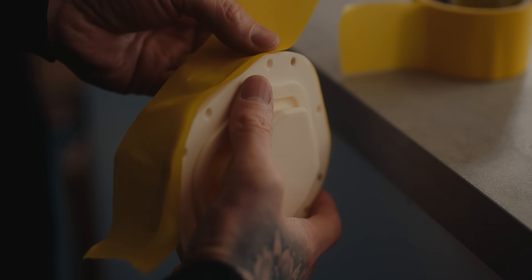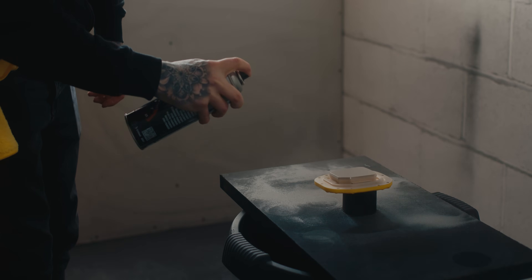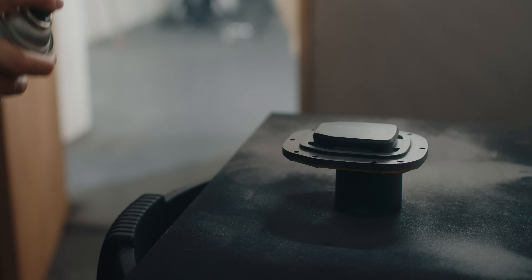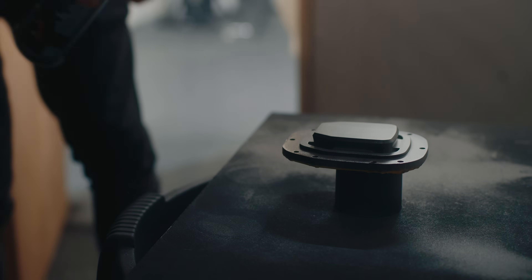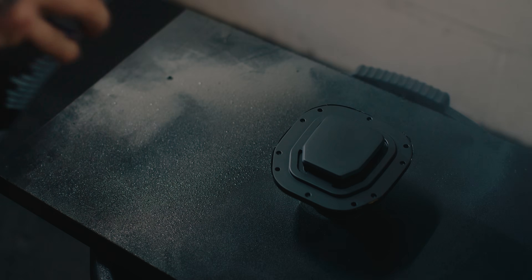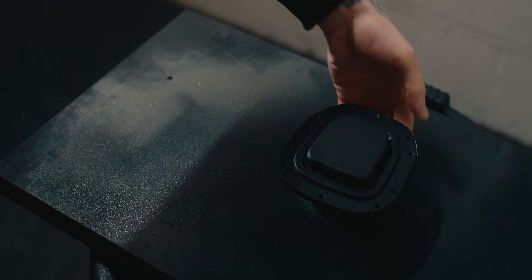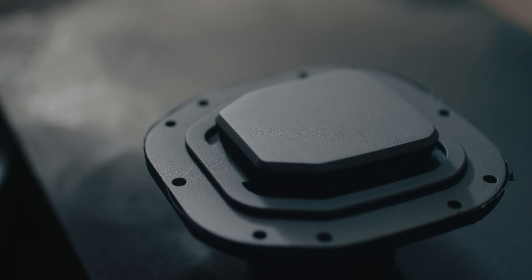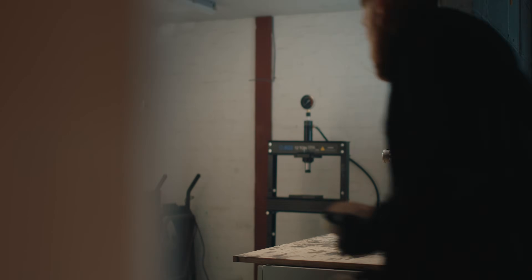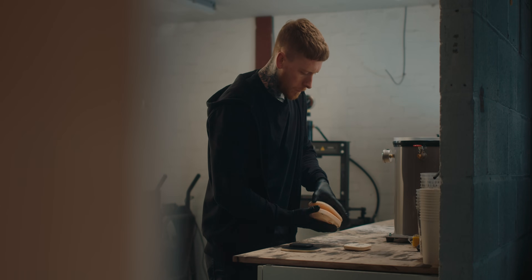There's not much prep work to do for pouring the silicon other than some prep work on the master itself. As this is a mould negative with the master built in, I need to finish it to look and feel exactly how I want the final component to look, as the silicon will capture the surface finish. I mist the paint on in multiple passes to create a grain, rotating the part for even coverage, doing this three or four times to build up the grain. If moulding the part, I won't touch the surface after, but it's important to allow the paint to gas off the solvents to prevent any silicon cure inhibition.